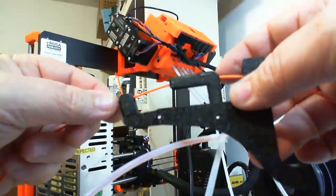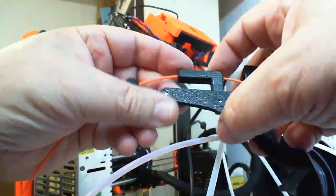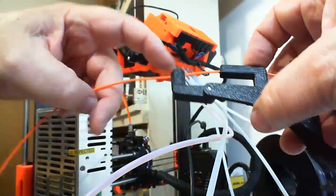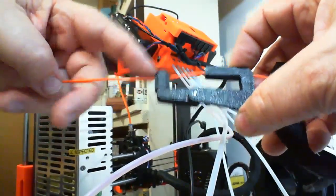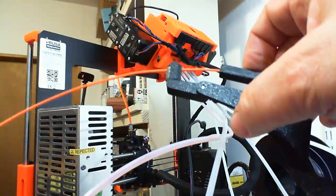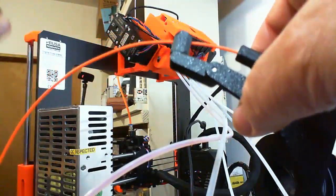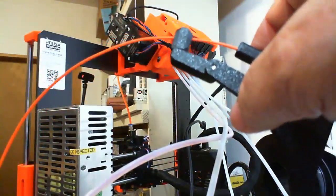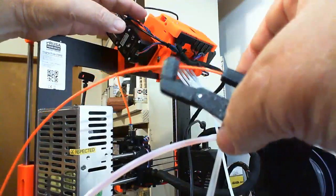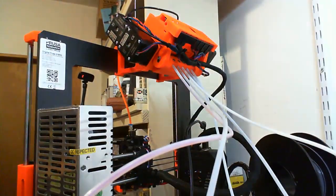And when it's printing with it like that, you can hear the filament squeaking. It kind of creaks and makes a noise as it pulls on this, because these two don't line up perfectly straight. And you've got to remember, this has a tube stuck in it, so it's creating a little S-bend in there. And that, I think, was causing some of the problem. I also had taken the extruder cover off so I could reload and do the calibration for all the individual feeders up in the MMU assembly. And I thought I had it fixed, but apparently not, because it quit again.